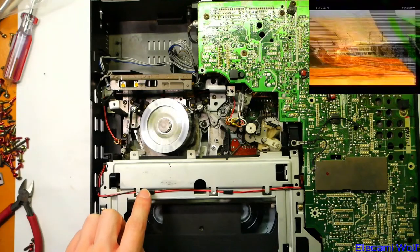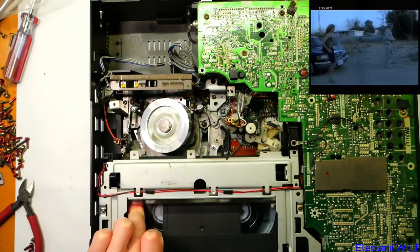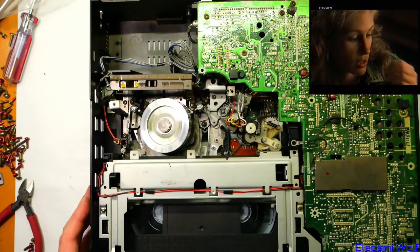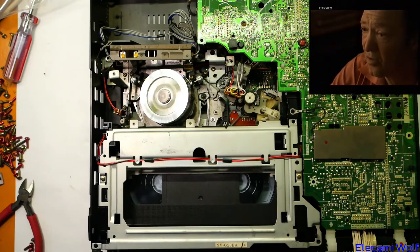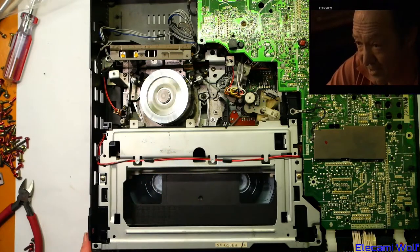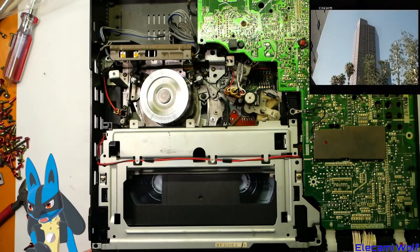Something's happening — I could hear it struggle for some reason just then. I'm wondering if it's one click out. Oh, there you go — it's an NVG20 mechanism in an NVG21 machine. We swapped over that little idler gear thingamabob and now that mechanism is working. That's exciting — good result. Perhaps probably means we could put this back into the G20 machine and it will be happy to work. Problem is we've only got one power supply that works. Anyway, hopefully that was interesting.